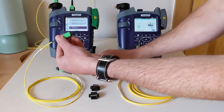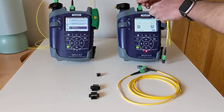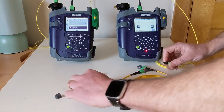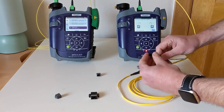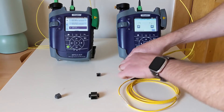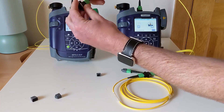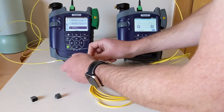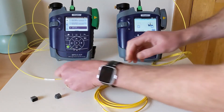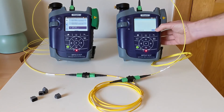Now I'm going to locate the unpinned end of TRC2 and plug it into the power meter. Then I'm going to mate it with one end of the unpinned cord, and take TRC1 — which I added the pins back into — use another adapter and connect it into the cable under test. We'll hear an audible tone confirming the units are communicating, and then hit next to do our test.